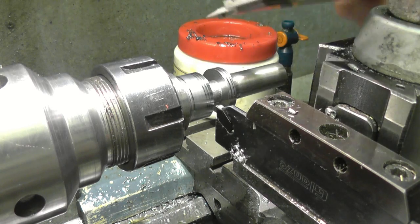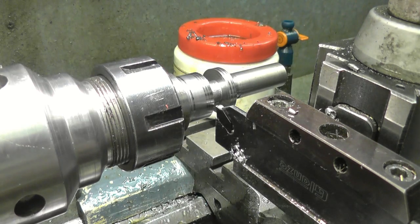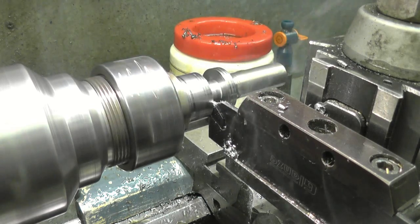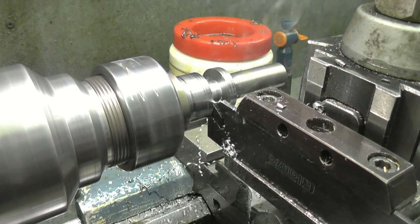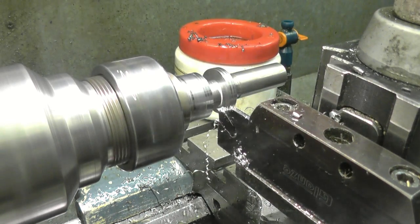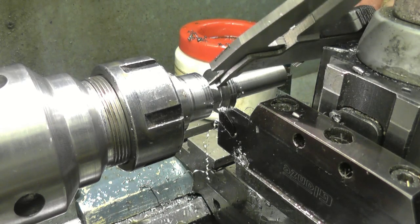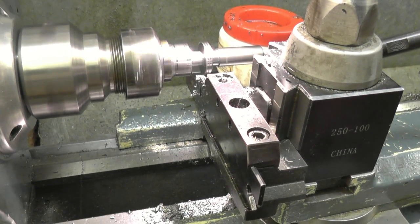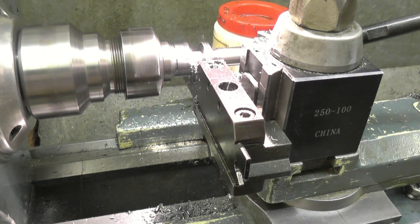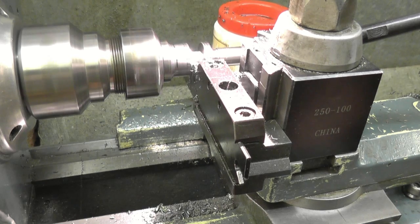Right, that measures 337 and I need 390. And I've still got 10 thou to take out of the bottom. Only get a little bit of flex on the tool, but we can just keep nibbling away till we get it right. Right, this should be our last cut. We're now down to full depth as well, that's down to 50. Just clean the bottom of the groove.